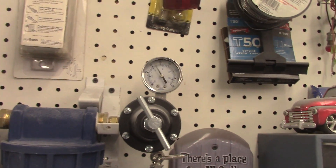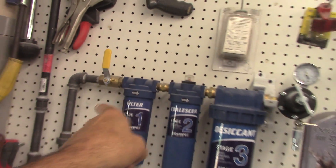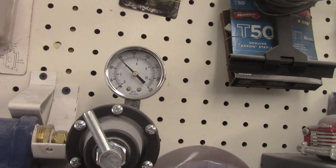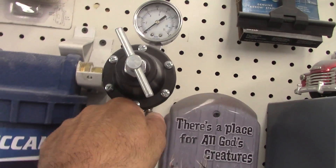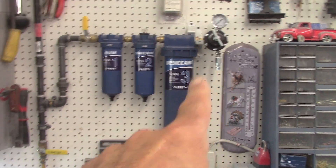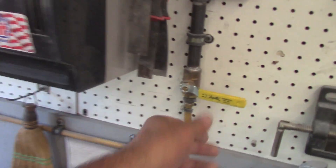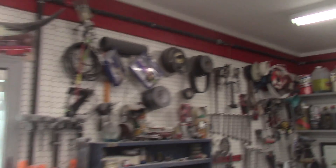That cuts the system on. I'll plug my hose right in here and cut it on right there. When I'm not using it I just kill it right there and release some of that air. That's where my hose is gonna plug in. I got about 25 foot of hose — I'll just plug on in when I get ready to paint. This falls coming right down here and drains back down, so a little moisture in it. That's my system.